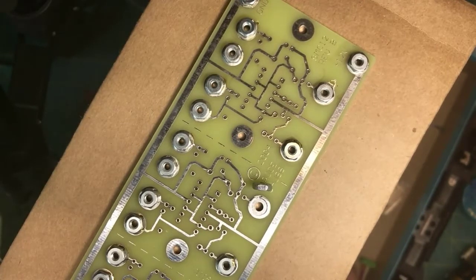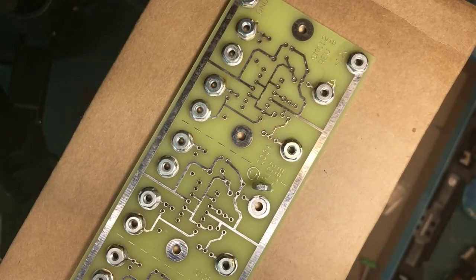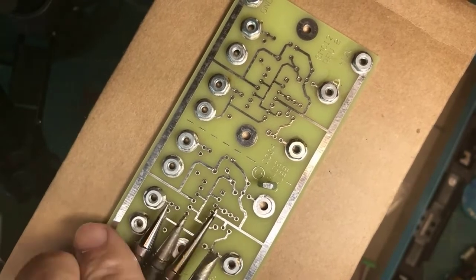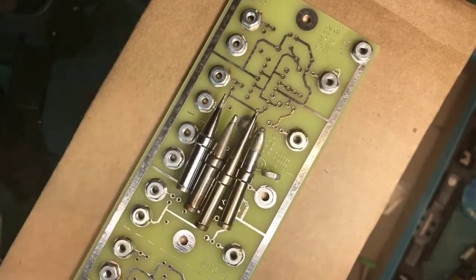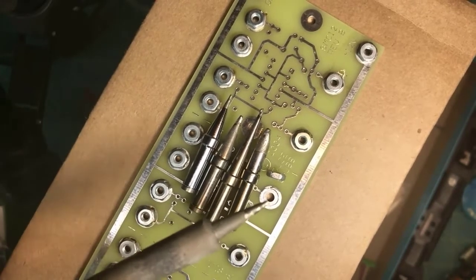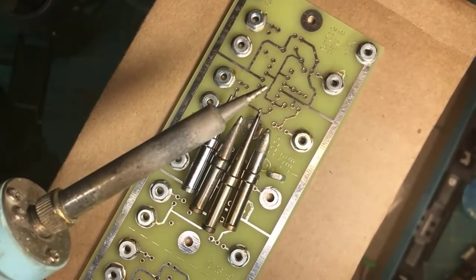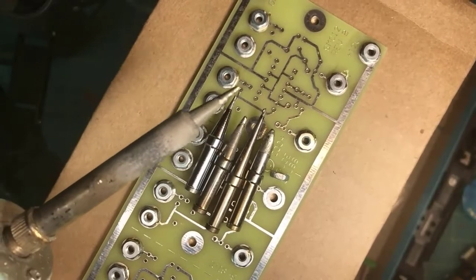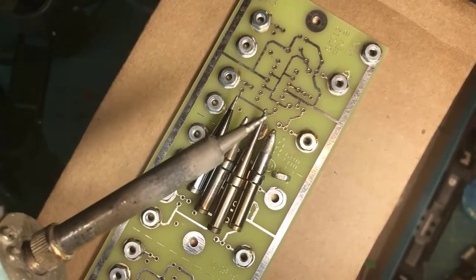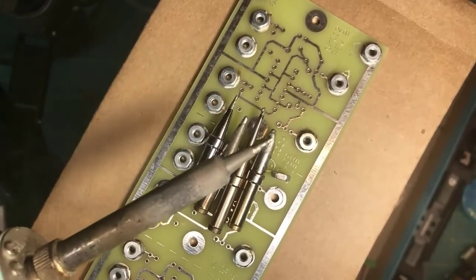And I'm going to digress here because the work you're doing and the solder tip you use make a difference. Okay? I'm running a Weller soldering system. And this is one of their older school, but still fine temperature controlled ones. This tip is the same as this one, but notice this very long, thin tip and a big heavy tip.